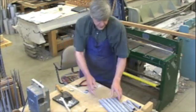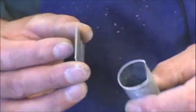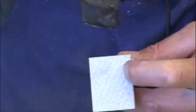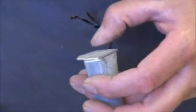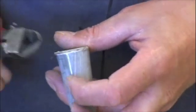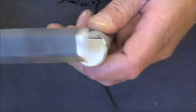Next step is soldering on the languid — it's called — that has a very smooth surface on the underneath, then a bevel and a slight blunting of the edge. Different sorts of stops and pipes would have different flues. Even different organs, depending on what the acoustics would be in a room, would have slightly different measurements, but it's all rather just like a feel rather than science.